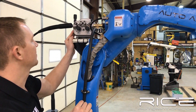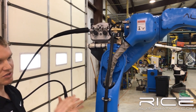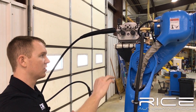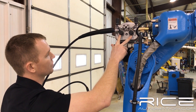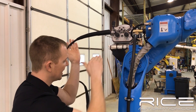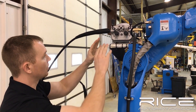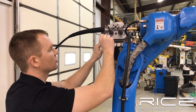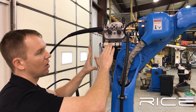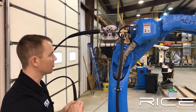I'm going to touch on the feeder just a little bit. This is a robotic wire feeder, but it looks a little plain Jane — all internal gearing, so none of your gearing is on the outside and the rollers are exposed. In a robotic situation you'll usually see a cover on it, but what happens with a covered feeder is the coating of the wire or anything that comes off that wire will build up and eventually arc off. With exposed rollers, it's all going to drop off. Also, all your solenoids and everything are accessible from here.